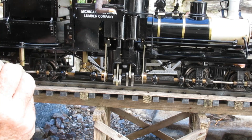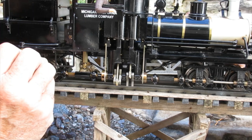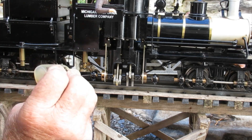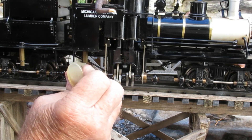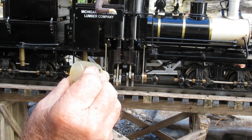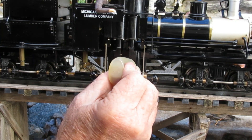It'll take several minutes to raise the steam pressure. I take advantage of this downtime to oil all the external moving parts of the engine with a high-grade lightweight machine oil like three-in-one. Oil all parts of the drivetrain and the wheel bearings. Oil everything, but oil sparingly. Excessive oil will make a mess and attract dirt and grit into your moving parts.